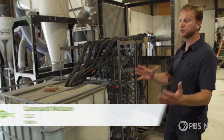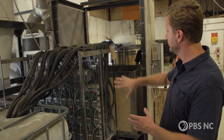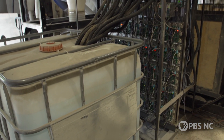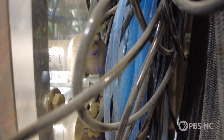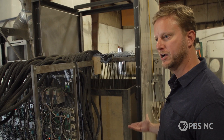A couple of main differences from a traditional 3D printer where they use a wet mix going through a single head: we use hundreds of injection needles and we're actually printing the water. We've got an aqueous solution running through a series of pumps with controller boards — just like an IV pump at the hospital that gives you medicine — we know exactly how much liquid we're injecting at every single position in the printer. So as we move along, we'll continue to print layer by layer.